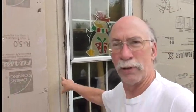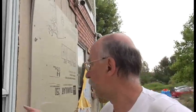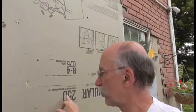I'm going to finish covering the wall with a backer board. Then you put furring strips up, and you screw your furring strips into the studs. Okay, because you got to remember, this Novabrik is kind of a stacked brick type setup, but it's extremely heavy. So you want to make sure that it's secured into studs to get the hold. There's a stud every 16 inches, so you want to put furring strips up. Put your board on first, house wrap, whatever you're going to do, then your furring strips, then your starter strip, and then the brick.